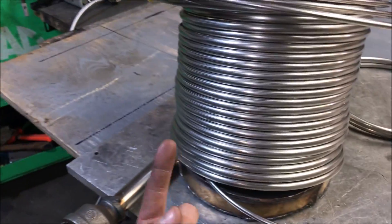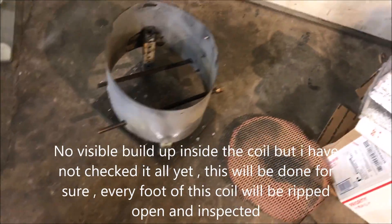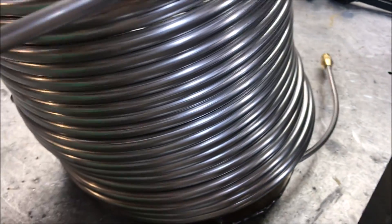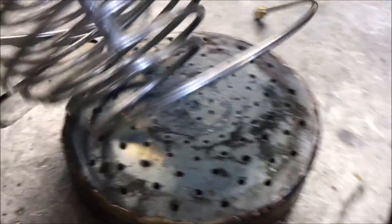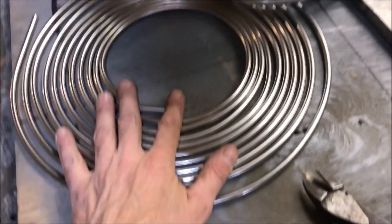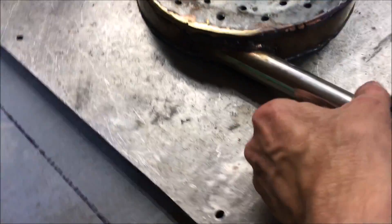On the bottom of this burner we're going to have our primary preheater. You've got your water wall, your boiler, and your superheat. We're looking at about 37 to 40 feet of coil here — that's what was in this boiler, not that much at all. This water wall in itself is 50 feet and this boiler is 25 feet. This grating that's going on the top — whatever's left over is going on the bottom of this hot burner. This thing gets red hot.